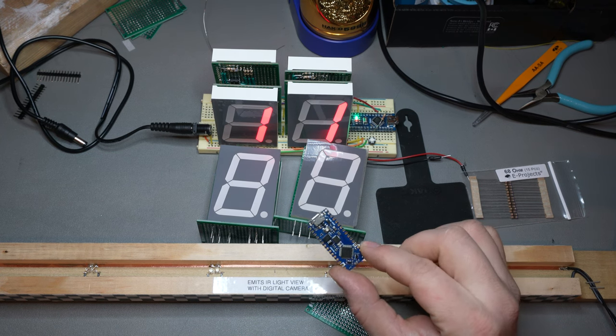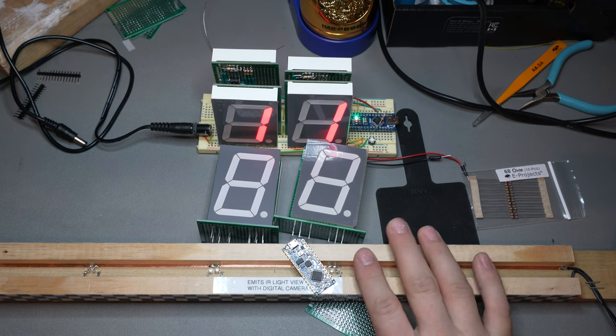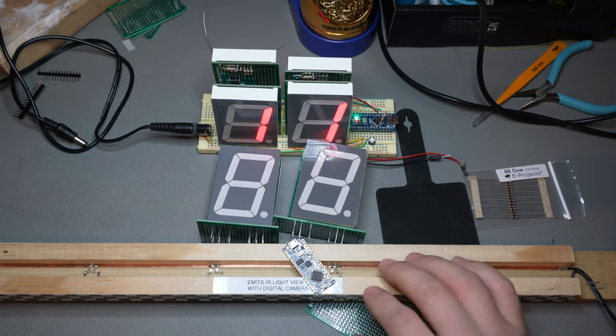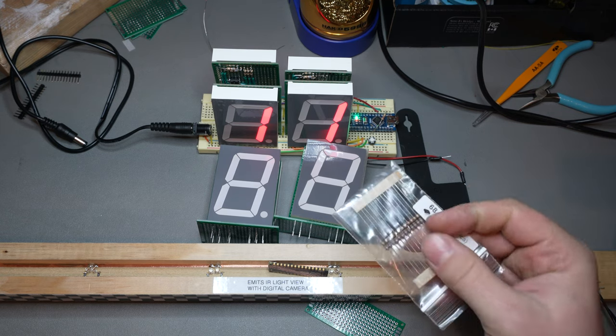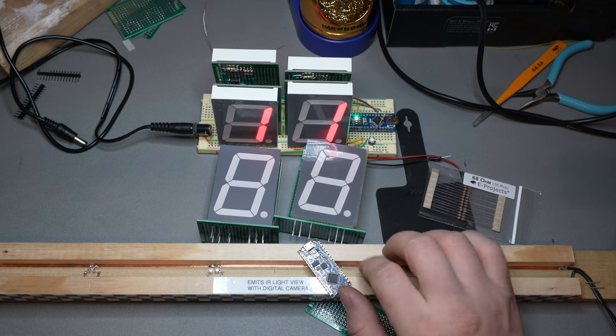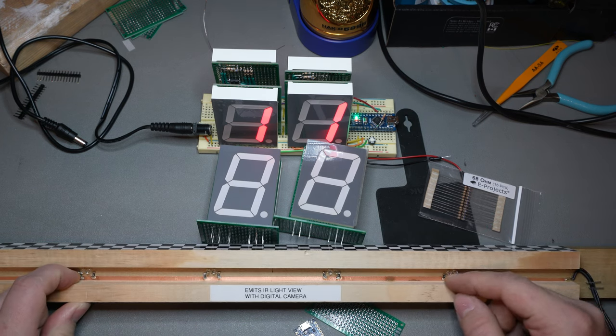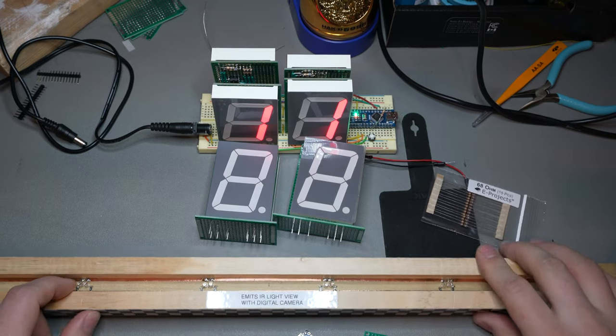We've got 950 milliamps. We're gonna be doing right about 400 milliamps or so through this. So this isn't gonna get hot. These resistors are gonna get a little hot, but they are rated for it and it should be good. So now we just gotta get to trying to desolder down in there without burning too much wood. So let's get to it.